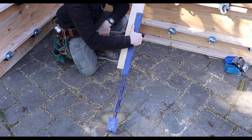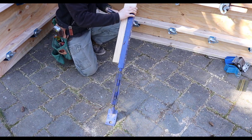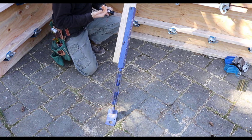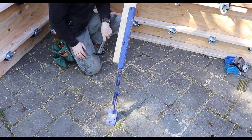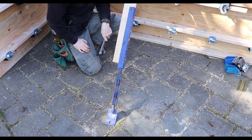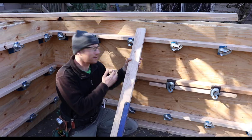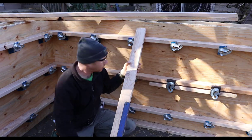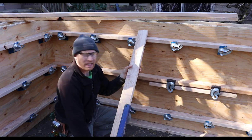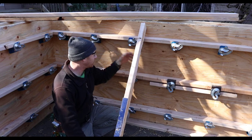Then you can take your 2x4, attach it to your formwork wherever you need it. Like I said, sometimes I'll attach it to a whaler, sometimes I'll attach it to a strong back. The strong back's kind of my preference because that's affecting the whole wall. You secure the top however you want, whether it's a couple 16 duplexes into it. Some people like to use screws. You can go on the flat. You could cut a bevel up on the top and have it notch in nicely.